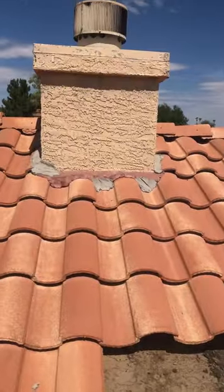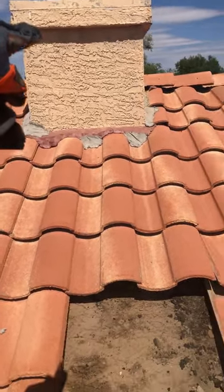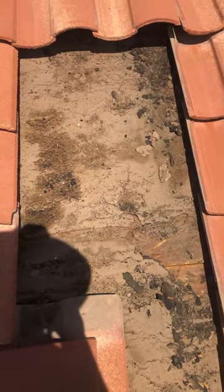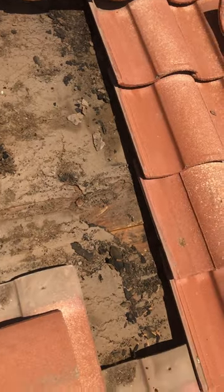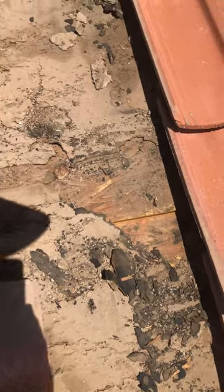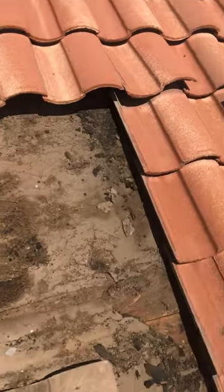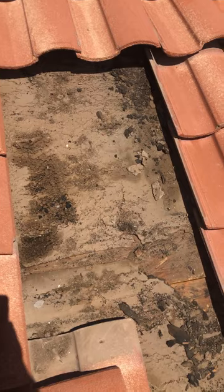This area is above where you're having your leak in your bedroom. From this chimney, go straight down — this is your underlayment. It looks full of debris and has a lot of deterioration. Looking closely right here, this is exposed plywood — your roof decking. The underlayment has completely failed here, leaving exposed wood. Water is going to flow right through here and get into your roof. This section is going to need to be repaired.